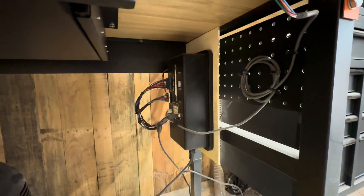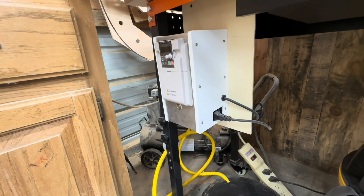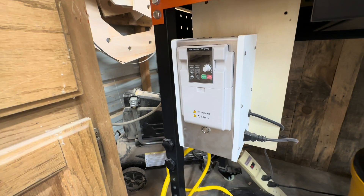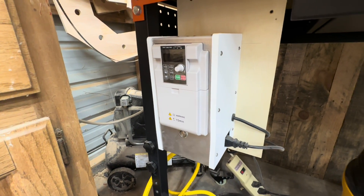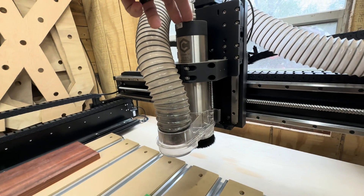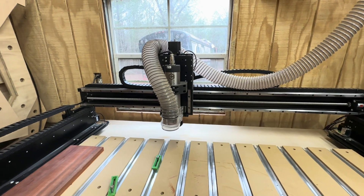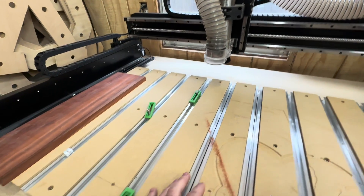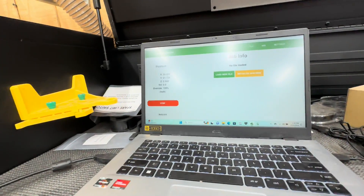This is the control box. I just screwed in a piece of plywood and connected it to it. With mine I got the VFD spindle, and it comes with this box to control it. I had questions about this box because it has a lot of different dials on the front — those are unnecessary, they don't do anything. This box is probably used for different machines; all it is is just a way to power the spindle. The VFD spindle is a lot quieter than a router, and that's one of the reasons I got it. I also plan on using my machine for production and selling things, so I wanted it to be able to keep up with the demand running stuff all day long. But the main reason I got it is because it's quieter.